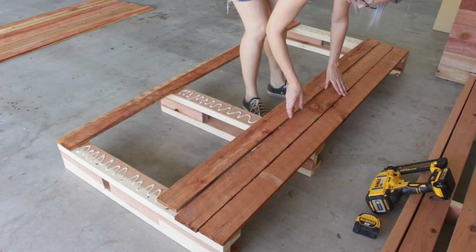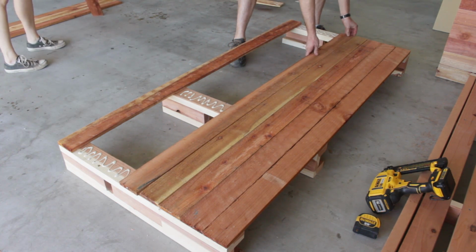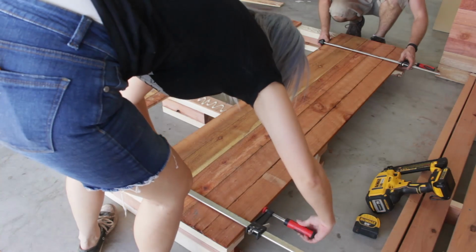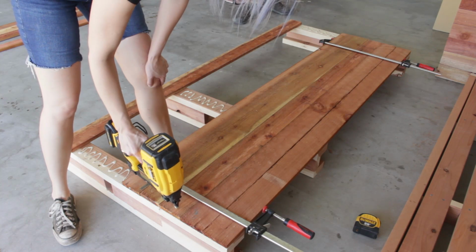In order to accommodate the storage trundle, which I'll talk about later, I actually didn't need the lowest piece of siding on the back assembly. In this shot, you can see that I attached it loosely with 1 brad in each corner. That was just to help keep it square. I later removed that board.